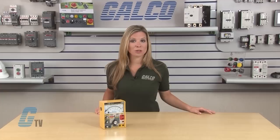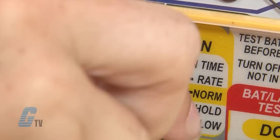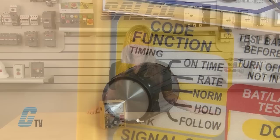With the 2000 Series, peak levels can be determined quickly and adjustments to the code equipment peak level can be made without constantly readjusting the test set. A peak hold function can capture and hold the peak level of the signal. If the peak level varies slightly, the test set will take 25 of these readings to give an average peak level. The peak follow function is used to follow the peak level automatically and permits easier adjustment of peak levels.